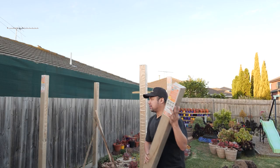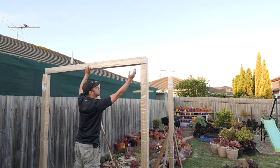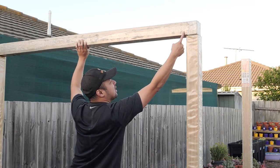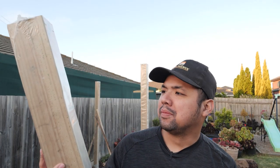One of the things we have to do is work out where the arches sit, and what we have to do here is mark out where we would be creating the notch. In this case it would be somewhere around here and this deep — so maybe we would chop half of this. We're going to do that for both sets of posts so that each of these horizontal beams would fit their intended locations.